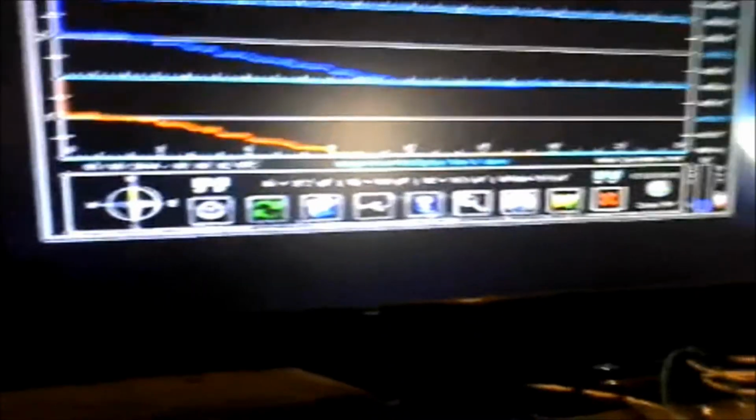And if we look at the digital magnetometer, it's measuring on the BT. Right now it's at 50 microteslas, so that's very close. That's only 4 microteslas difference, and that's probably accurate because these two sensors are about 50 feet apart. That value is being taken in a totally different room, actually with less noise, so that makes sense. I'm measuring 50 microteslas on the digital, and on the Fluxgate, in this other room, I'm measuring 54 microteslas.